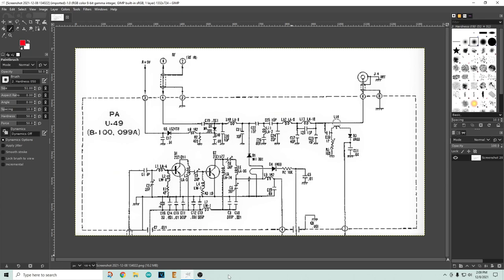So let's take a look at the amplifier. We have two transistors — a drive transistor and a final output transistor — and these two transistors are the whole amplifier. That's all it is. They're both NPN transistors. The ground lead comes in here, so the emitters of these two transistors are grounded.